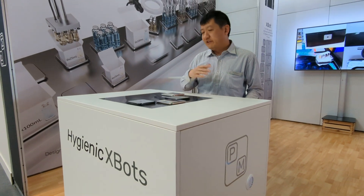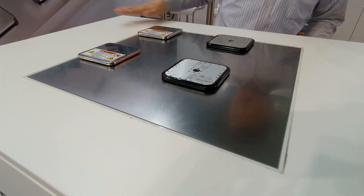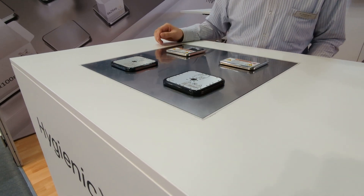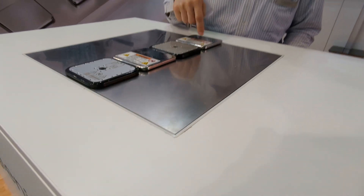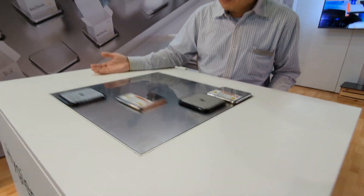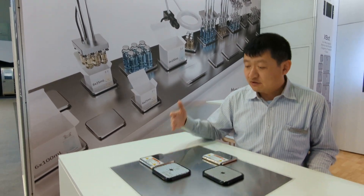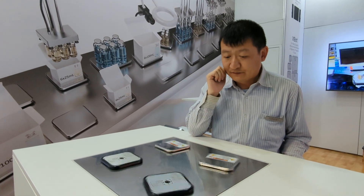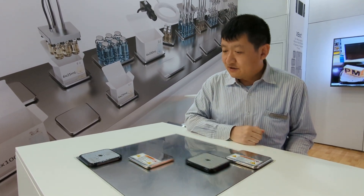Imagine a clean motor station where the movers are integrated into a machine. You can use stainless steel to cover the whole stator to form a flat working surface. On top of that, movers can just fly over it. We have both the standard version of the mover and a special aseptic or hygienic mover. These movers are used in very clean environments — for example, pharmaceutical, meat processing, food processing. They're good for wash-down and VHP cleaning with H2O2. The movers are fully encapsulated inside stainless steel, so there are no holes, no particle generation, making machine integration very simple and easy.